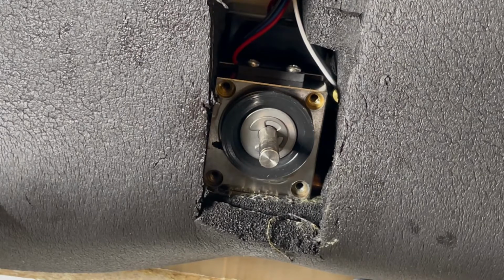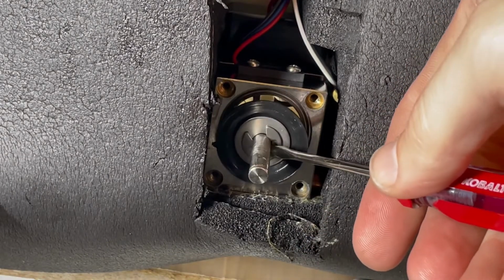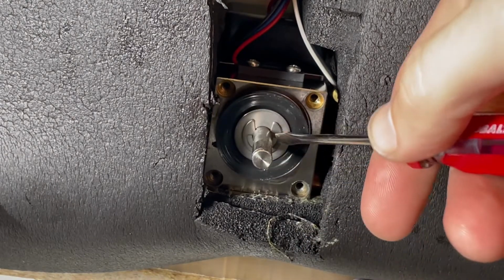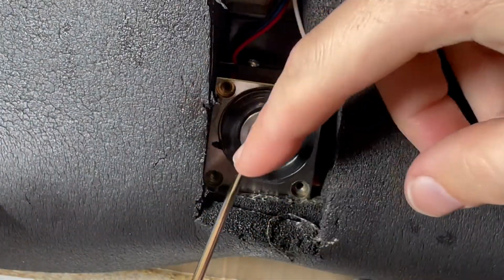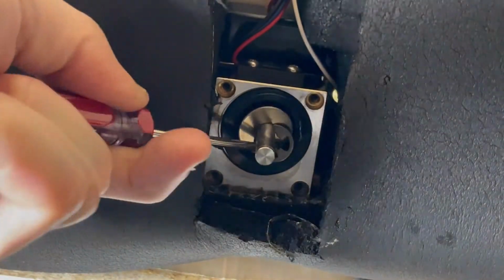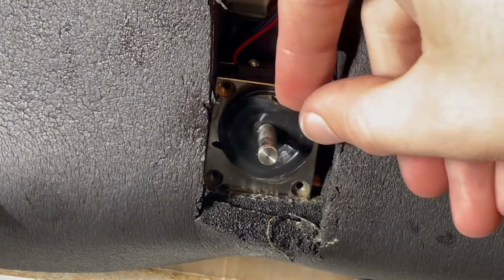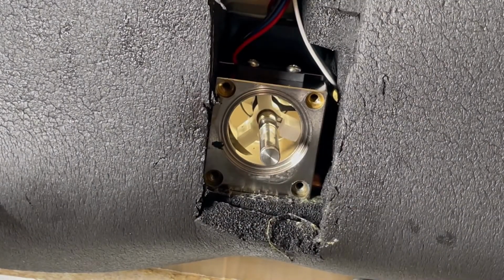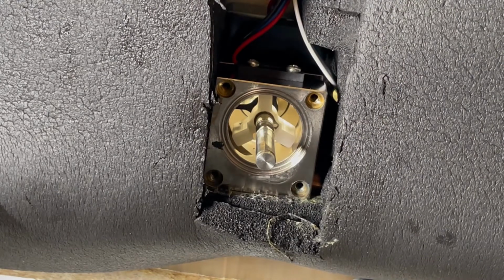much like with our first set of E-clips, or just one E-clip rather, just take your tiny screwdriver and see if it pops out. Yep, that'll often come flying out, and you should be able to just take your finger, pull down the diaphragm there, and now see how that's free, and we'll just be able to pull that up through the top.